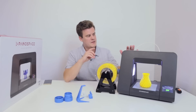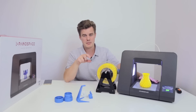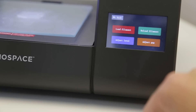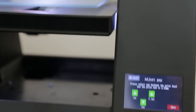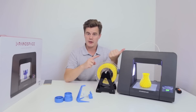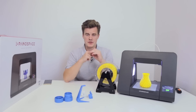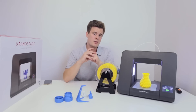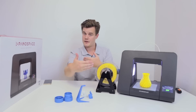This little machine sports a direct drive extruder mounted on a linear rail making up the x-axis. It also has a 150 by 150 millimeter glass bed mounted on the y-axis, but this also moves up and down, so you have a machine very similar to the normal RepRap style of machines. The glass plate is a cold plate — it's not heated — and you actually use some glue to get everything to stick down.